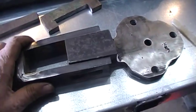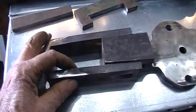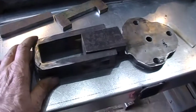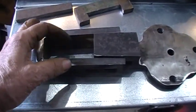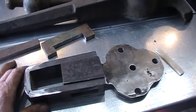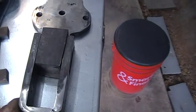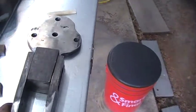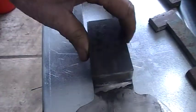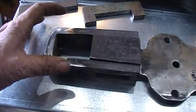On the other one I used some 20- or 22-gauge sheet metal — probably around 30 thousandths — clamped in between here to give spacing. On this one I forgot to put it in there. So what you get is the sides aren't really parallel, but it's really not necessary. You can make all this stuff to fit. What I had to do was take the clamps off, weld it here, and let it swell out a little bit so I could get it off the vise.